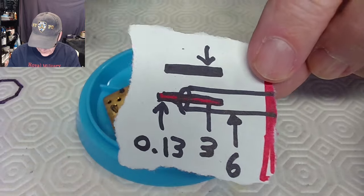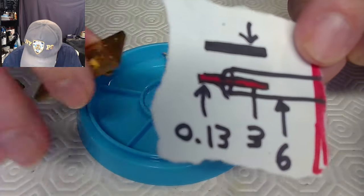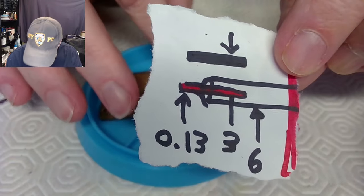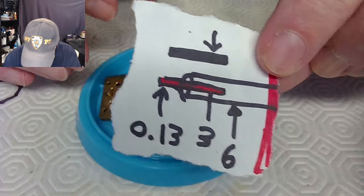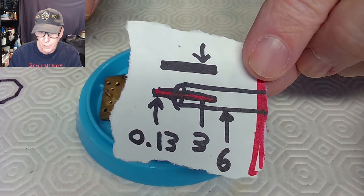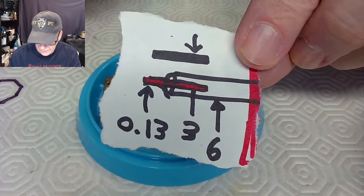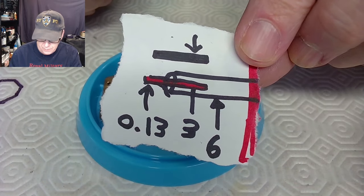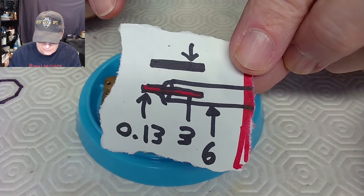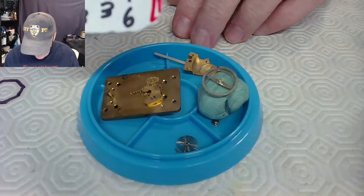I have a piece of stock in here somewhere. Anyway, I've got a piece of stock that's actually 3 millimeters — I'm going to drill a hole and put that in. Then 0.13 millimeters is the pivot size, so it's a tricky job — very tricky job — especially because I can't find that piece of stock right now.